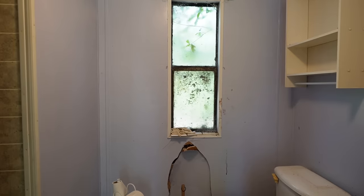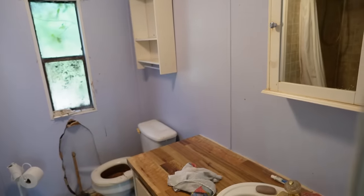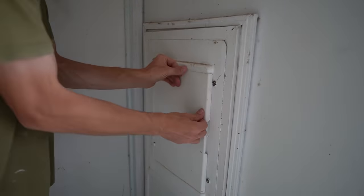We're definitely going to have some rot in the floor and framing in this room. There's a little window in there, and a vanity. The reason we're keeping the power off and using it minimally is safety — we don't know if there's anything wrong with the electrical. Some of the lights weren't functional and we don't know much about the home yet, so we're keeping it off to avoid anything shorting out. The house does have power, we're just being extra cautious. We've seen this problem in other mobile homes and it's usually a bad connection in the wall somewhere.